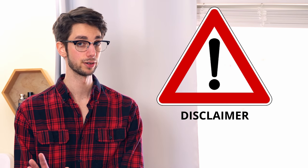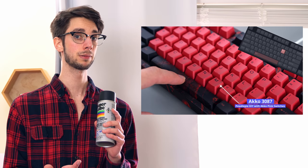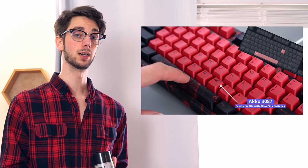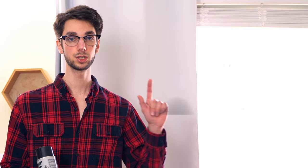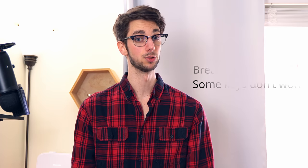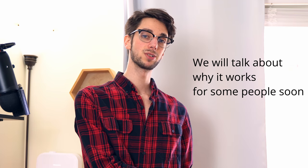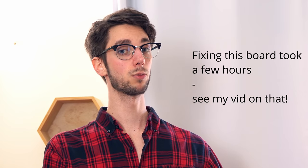I'm not 100% sure of this — this is just my opinion of why it'll break your board. When it gunks up the contacts of your switch, when you press down your switch, you get nothing. Breaking a board with spray lubing is a variety of input issues, but I boil it down to: it will break your board. A variety of input issues is not something you want to deal with when your only goal is saving time, because troubleshooting those issues and fixing the board took more time than just desoldering it and brush lubing.